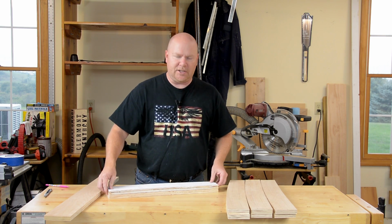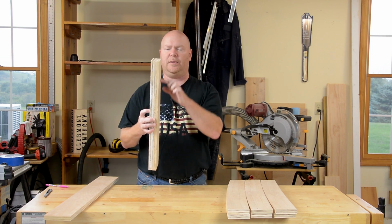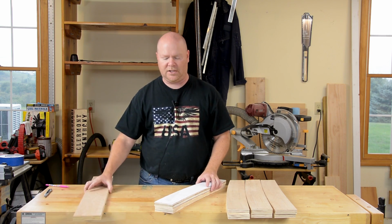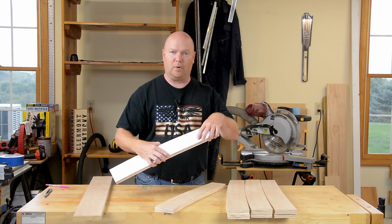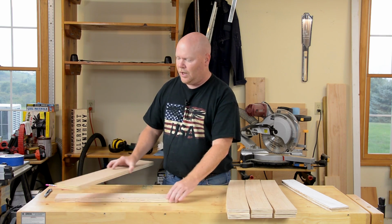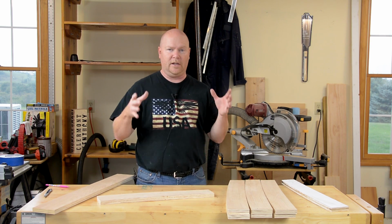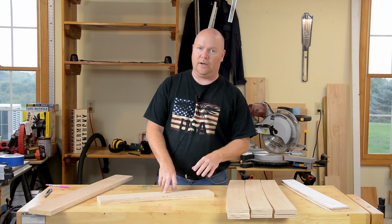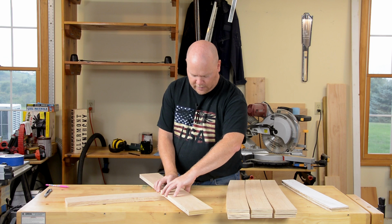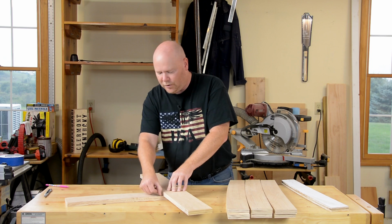One last fabrication step before I glue these up. The back of the two pieces needs to be chopped down to fit the side rail of the table box. And there is a line on the template to mark where that should be, but quite frankly, it's a little safer to just grab whichever is the uglier of your two legs. It's probably gonna be the one that was on top of the stack when it went through the chop saw, because that does not do nice things to the veneer on the plywood.